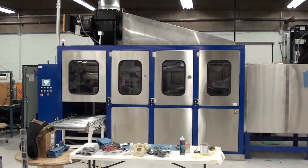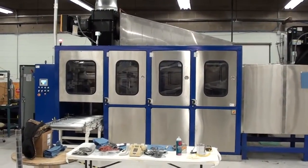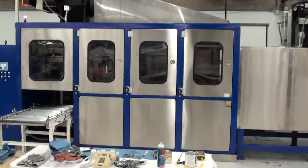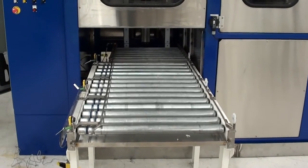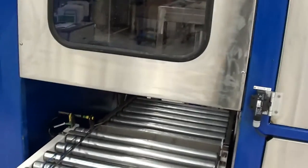Today we're looking at a fully automated wash, rinse, rinse with regenerative DI cascade overflowing rinse tanks for an aerospace application. Fully automated with two-by-two tank baskets that are automatically loaded on this infeed conveyor, capable of three baskets two-by-two with foot partitions for various parts. We have pneumatic rams that lift platforms up so we can load at ergonomic heights while keeping the tanks at full tank depths required for the process.